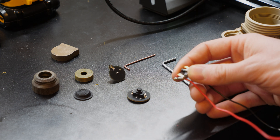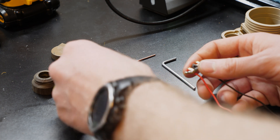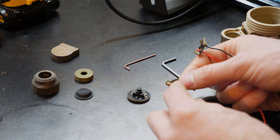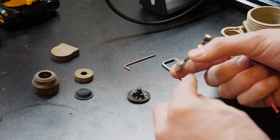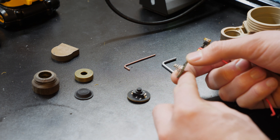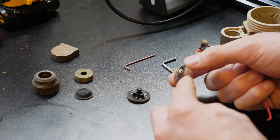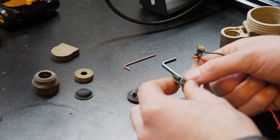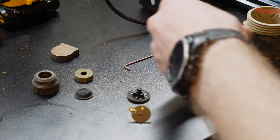The biggest thing to note is that on the left side is the positive side with the red wire, and that will attach to this piece and goes into the smaller hole right here. So the red wire attaches to that smaller hole. You solder on the spring — and this is all if you're getting the kit from the person who makes the PVS-69, or I know Hey There Hero sells them as well. You solder the spring onto this board.